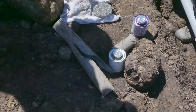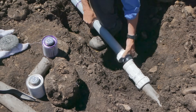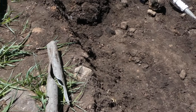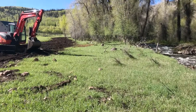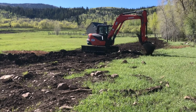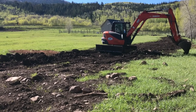The process was complicated by snags in the conduit, which had to be identified, consequently unburied, and repaired before the job could be completed. The folks finishing the burial at the end of last year's work did not take adequate precautions in the bedding, and the conduit was damaged, as you can see. It is a strong lesson in the proper bedding of both the conduit and penstock, which can easily occur when the soil is filled with heavy rocks, as is typical in a streambed region.